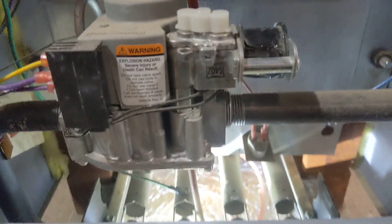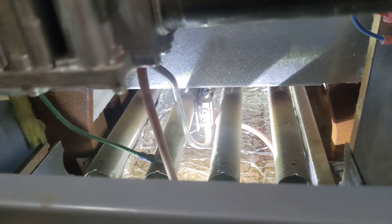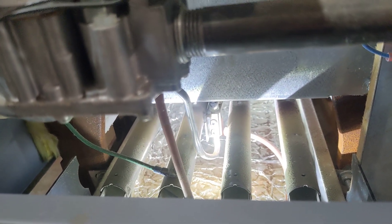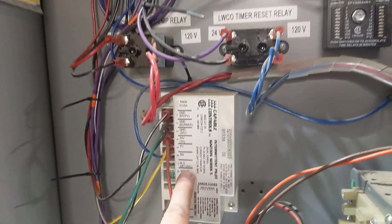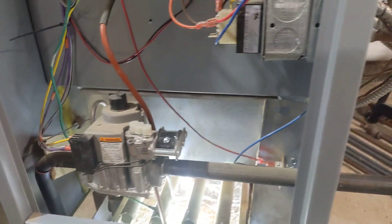The only way this controller and this intermittent pilot system has a gas safety — making sure there's a flame present during combustion — is the flame rod that's embedded in the pilot light flame. The flame rod is basically just a metal rod that goes into the pilot light flame, and electricity tries to go through the flame using what's called flame rectification. A flame has electrically charged ions in it, and if you put an electric field on it you can get current to flow through it. The controller looks for a current through that flame, and if it doesn't see a current it assumes the flame isn't there and shuts off the gas supply to the main burner, so you aren't filling your house up with gas.